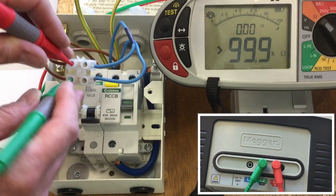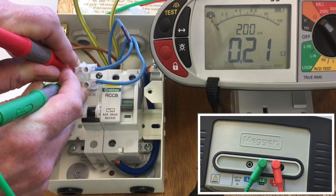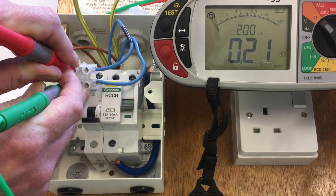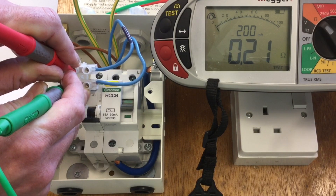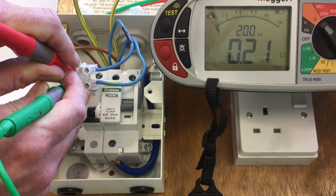My first reading is taken at the connector block itself. We know the reading should be 0.215 plus or minus 0.05 of an ohm. Measuring across the connector block I've got a reading of 0.21 within the distribution board, which matches the reading I expected via my calculation. The first part of stage 2 is completed — and it's the one people generally miss. They forget to carry out the test within the consumer unit first before going around and checking each socket outlet.